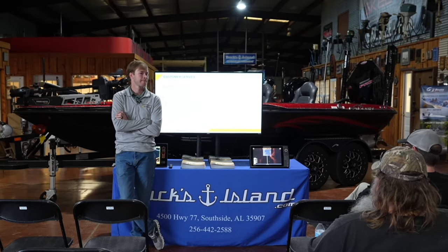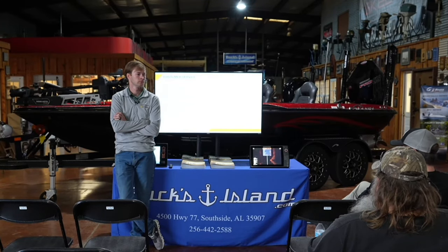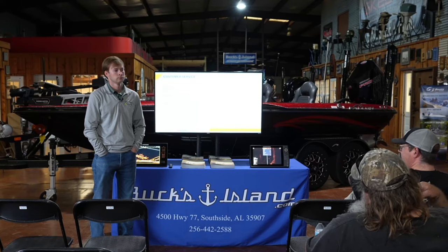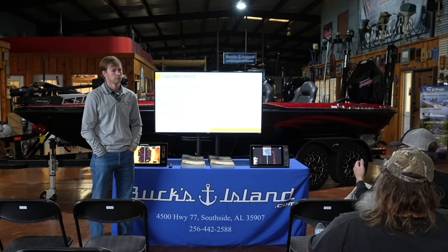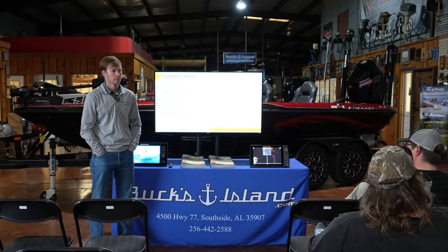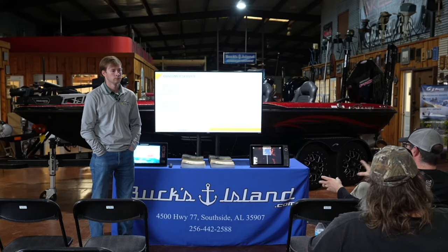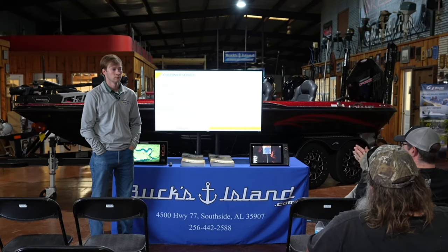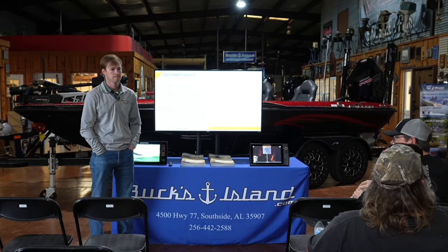About running an independent battery versus a lithium starting battery — I've found that sometimes you have a tendency of getting more interference when you have boat components hooked to that battery. That's why I suggest people have an actual independent battery — you never know what your engine might do. There could be a short that would cause interference on your graph. If you run things independently, when you have an interference issue you know it's probably something to do with the wires from that battery to your graph, not everything else. It's easier to find issues with an independent battery.